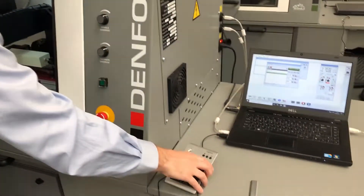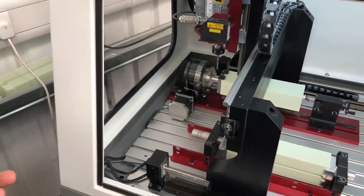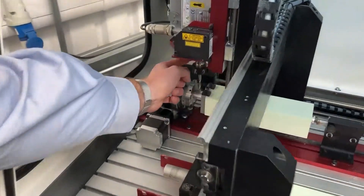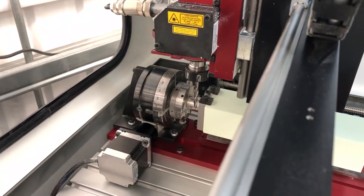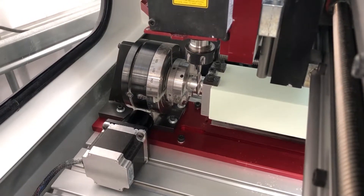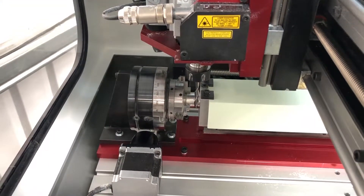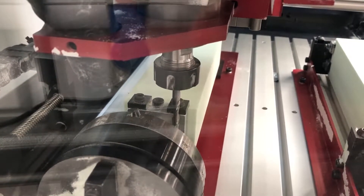Put the caliper down, pick up the keypad and move the tool back down so we can set the Y axis. We need to make sure the tool is rotated so the full width is touching on the side of the bar, and we must get past halfway down on the spigot. Move across slowly from the window at the side of the machine, making sure we don't touch the spigot itself as it is aluminium and you could risk breaking the tool. Then go back to the computer and put the three arrows on incremental movement.